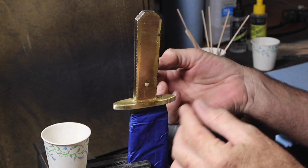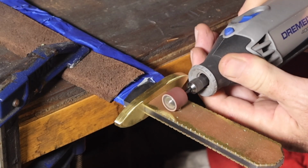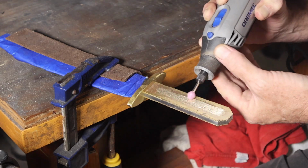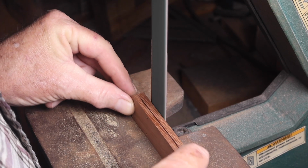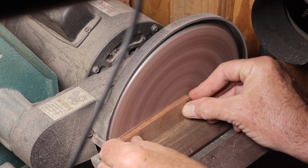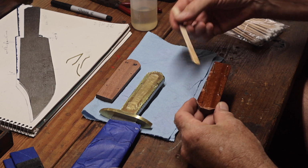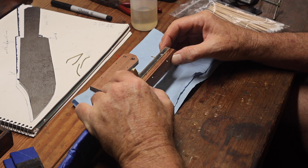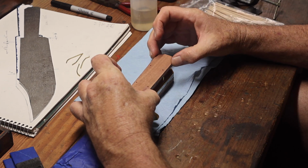There's the 3/16 inch brass rod, and it's all held together with epoxy as well as the mechanical fastener, the rod. So after the glue dried, I ground out some hollow spots on that brass just to give the glue more of a bonding surface for when I glue the scales on. Again, G-Flex epoxy for the scales and the 1/4 inch brass pins to hold the entire handle together.